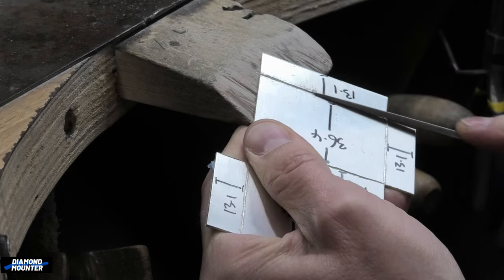I want to make sure it's going to work with the insert inside — it slides in nice and tight. The sound of quality! But I need this little bar in there — that's what the catch does. I've marked the distance and cut this down. It just sits on it. I've got to get that soldered in, and then it's done. I'm just going to touch a bit of solder on top there and let it flood down — it just needs to hold its position.